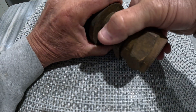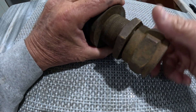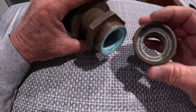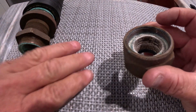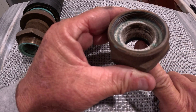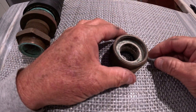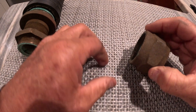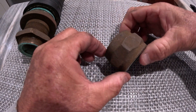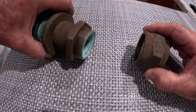Here's where we were working — this is the meat of it. I'm going to back this locking nut off all the way to the end. We cleaned the threads off for the customer. There it is right inside there — see how we pushed it? There are three rows in there if you look closely. All the way back here was our first row when we put that around the shaft. We went ahead and put the stuffing around the shaft and used our fingertips to push it into the nut so the nut can have some threads.